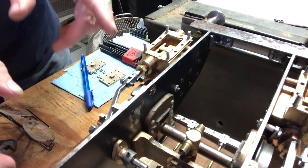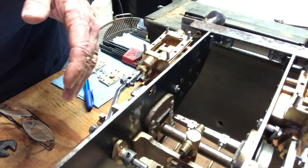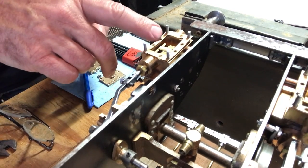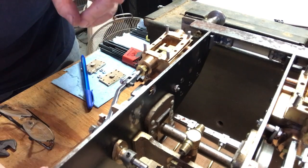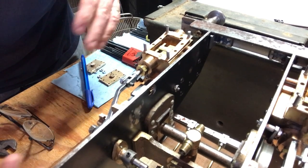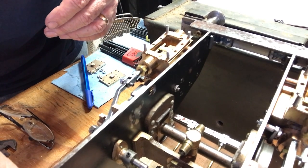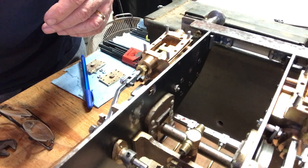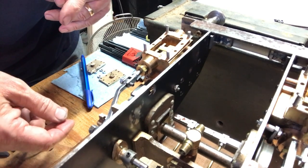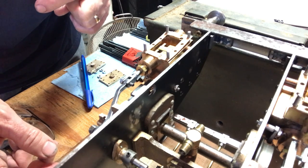Alright, now I'm going to do the checking thing on this side. I'm not sure what's showing up on the camera because I've got my little iPhone focused down here. I know the cylinder shows, but this is the cross-check portion, from page 89 or 90. It says, now that I've got the crank pin set, turn the wheels by hand in the forward direction and watch the valve, and note the position of the crank pin when the black line appears at the rear of the valve.